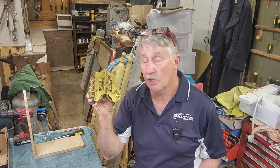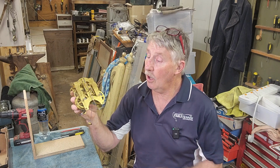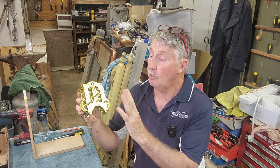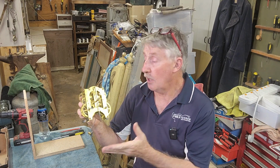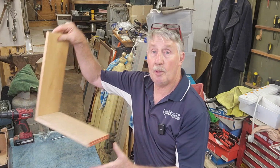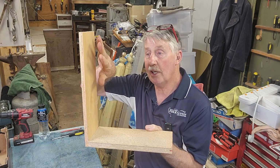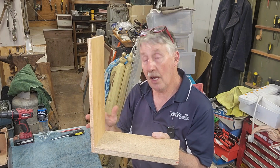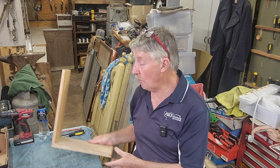In the last episode we got it completely assembled, and after cleaning and everything it all went back without too many hitches. It was quite fiddly work and it runs. Since the last episode, I've fitted the suspension spring on the front. We do need to oil it, so that's next. Then we'll mount it on a test stand. I made up a little test stand, just a couple of bits of wood, to give us somewhere to screw the clock so we can have it level enough to run for a week. It is an 8-day movement, so it should go for a week.